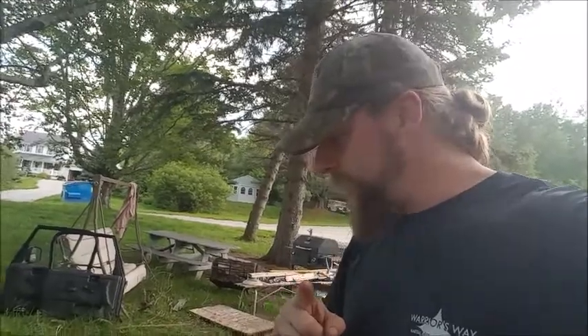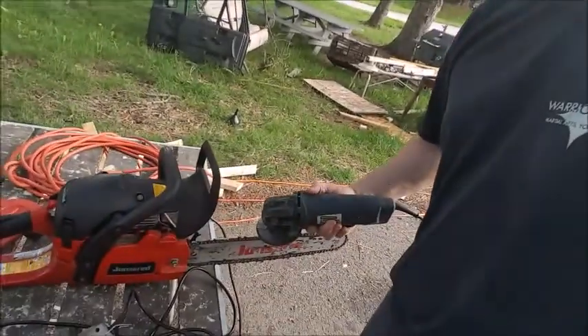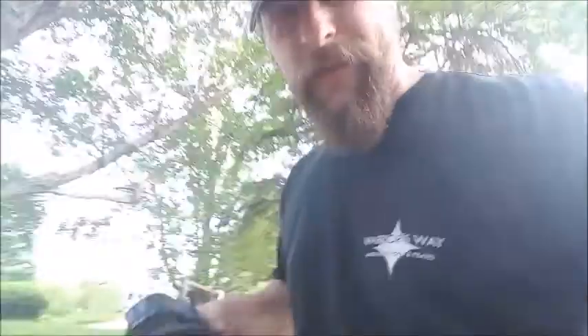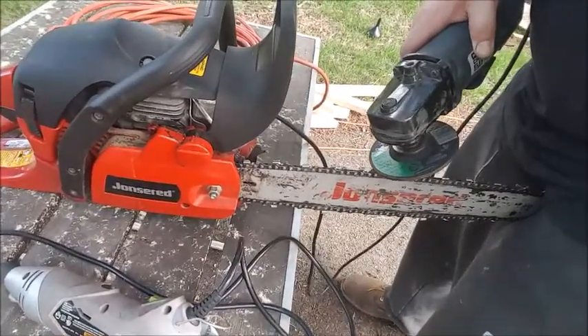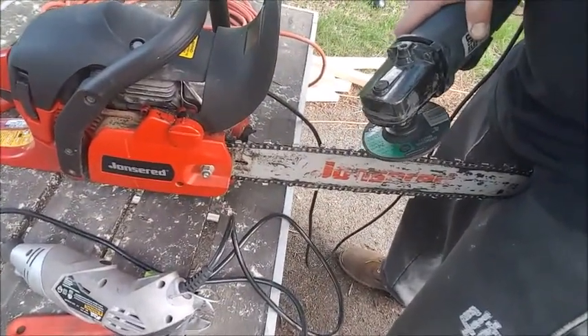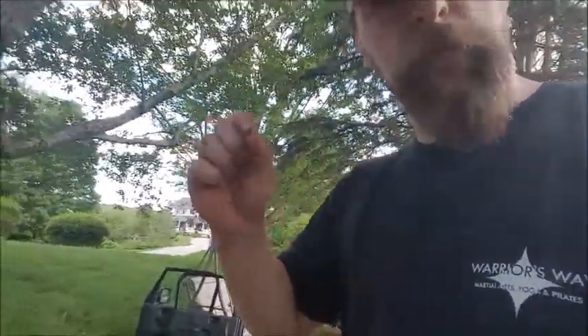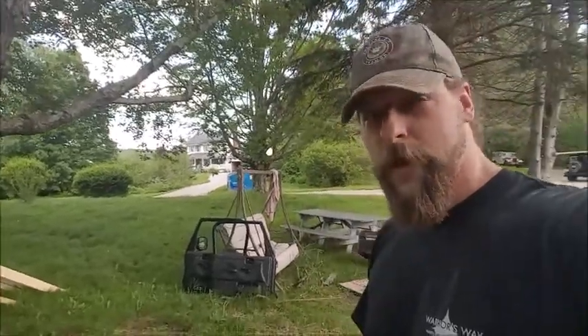Don't be stupid — if you get hurt doing something, it's your own fault. Take your grinding wheel and just hit that high spot on every single one. The way I stand is I put the chainsaw right here in my thigh, and I take the grinder with both hands and just hit it like this — boom boom boom — on every guide. Your chainsaw chain is probably going to be sharper than new. Good luck.